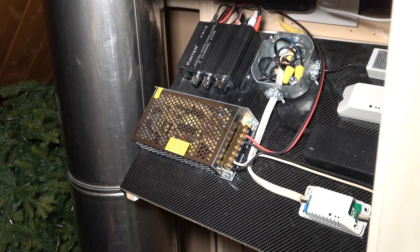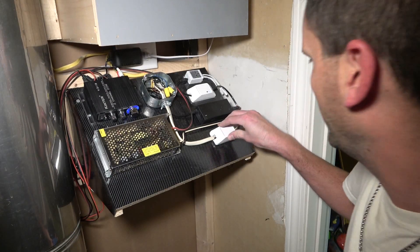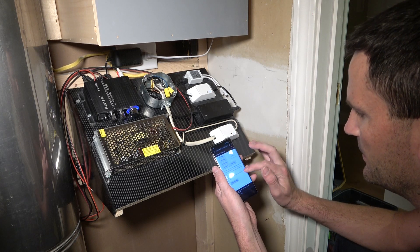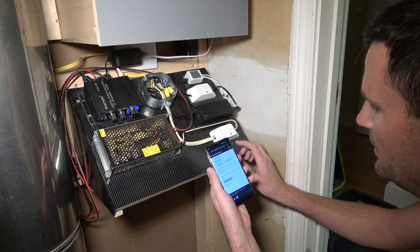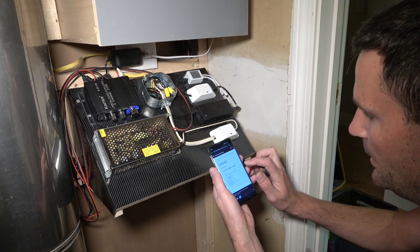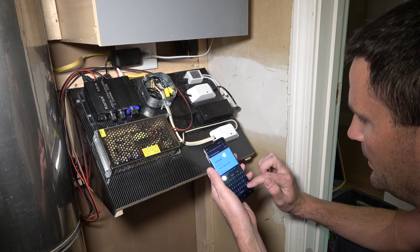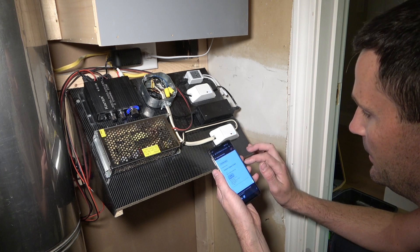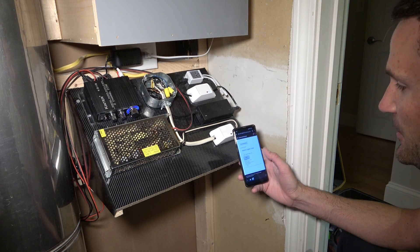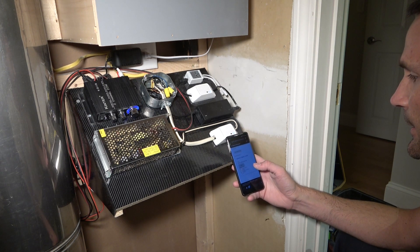You can boost it where you need it and dial it back where you don't. So let's go turn the power on and see if we can't blow it up. All right - got a flashing blue light, nothing's burning. I'm gonna add this device to our network. I think these are Zigbee - start Zigbee pairing, hit the switch - yeah, it is Zigbee. All right, so this is going to be named 'beam lighting, right side.' That's a long name but I'm not going to need to say the entire name to activate them. We'll program that to use more natural speech patterns, but it's important to me to have full descriptions because I've got over 200 switches in the house and it's easy to get mixed up.